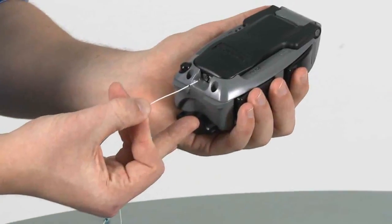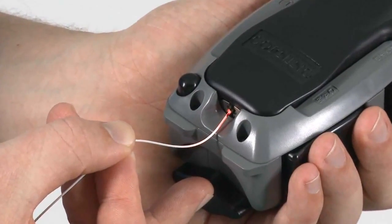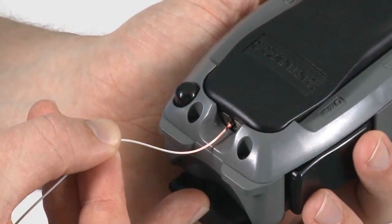First we need to insert the cleaved fiber into the fiber lead-in tube. Apply slight pressure until you feel it reach a positive stop. Your visual marks should get within one millimeter of the lead-in tube. Apply a little more pressure — you can put a slight bend in it. This will hold the fiber in place while you cam it.